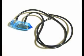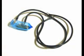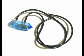A common type of sealed contact switch is the mercury switch. Mercury is a metallic element, liquid at room temperature. Being a metal, it possesses excellent conductive properties. Being a liquid, it can be brought into contact with metal probes to close the circuit inside a sealed chamber simply by tilting the chamber so that the probes make contact with the liquid metal. The mercury switch is tilted one way to close the contact and tilted another way to open it. Aside from the problems of tube breakage, spilling mercury — which is a toxic material — and susceptibility to vibration, these devices are an excellent alternative to open-air switch contacts wherever environmental exposure problems are a concern.